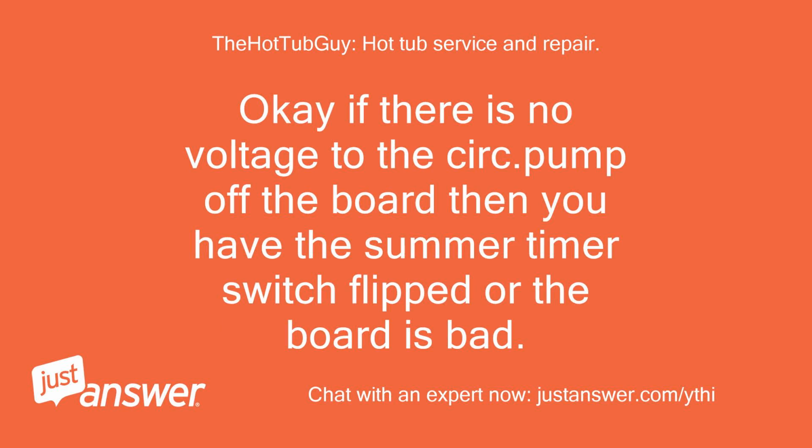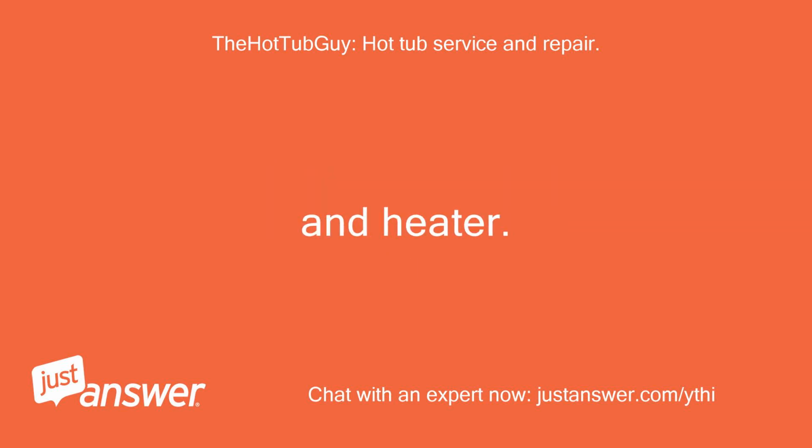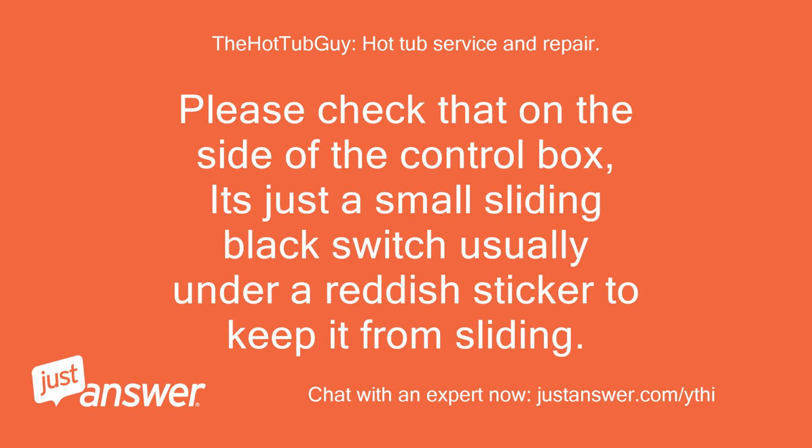Okay, if there is no voltage to the circ pump off the board, then you have the summer timer switch flipped or the board is bad. That switch in summer mode would disable the circ and heater. Please check that on the side of the control box, it's just a small sliding black switch, usually under a reddish sticker to keep it from sliding.